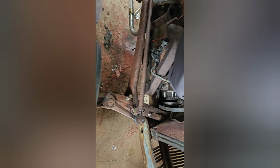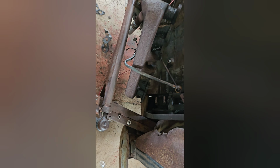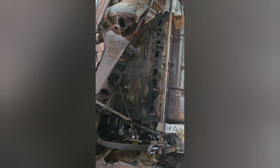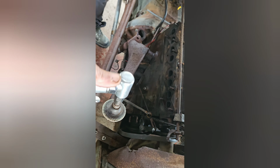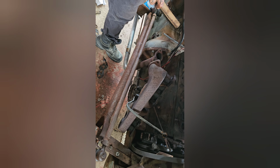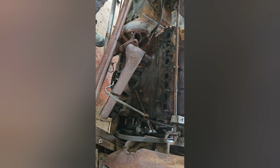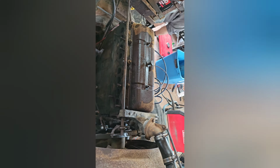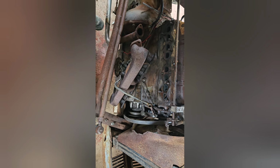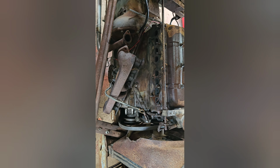We've got the manifold off. We spared you the grief of watching us undo all these little tiny nuts that hold this thing onto the studs. So right now he's just cleaning the gasket surface. We're going to get it with this bad boy, polish it, and we'll be able to put the new gaskets in and put it back together. While we got everything apart, we're going to check the valves for lash, and we'll get on to that. So yeah, we're moving right along. Everything's going awesome.